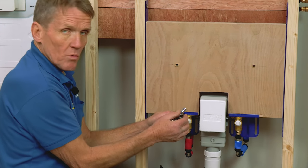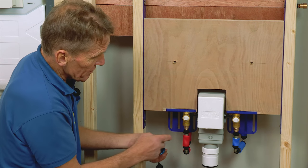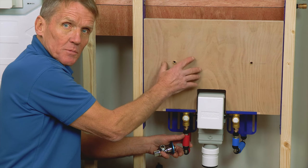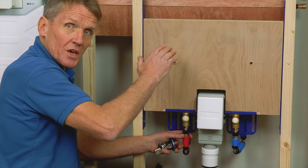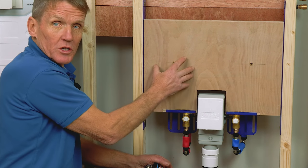With this frame you also get a couple of isolating valves which have adapters to suit any flexible adapters or pipe coming in by means of the bush, so that's really versatile. The other thing is you've got adjustability to move the basin up and down even when the tiling has been done, when you're ready to fit the basin. How often do you see a back fall on that waste? This just makes it foolproof.